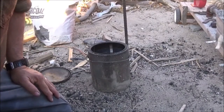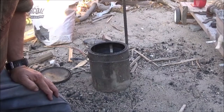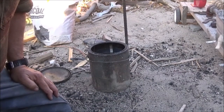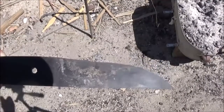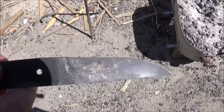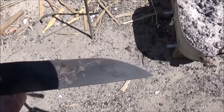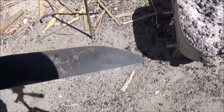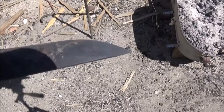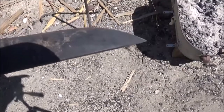So, now the next step is to temper it. And after that, tomorrow, polish it up, slap a handle on it, and then finish the handle. Okay, I didn't film putting it into the oven to temper, but you've already seen that in my other knife making video. It has a nice straw color right here, which means it's been nicely tempered. So now, time to polish this up. I'm going to use a combination of the Dremel tool and some sandpaper, more so just to save time.